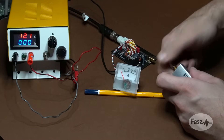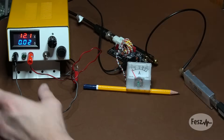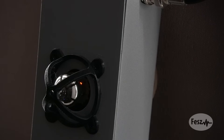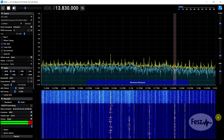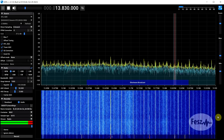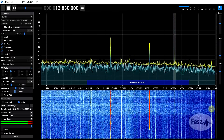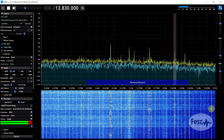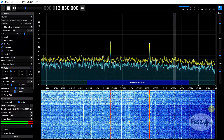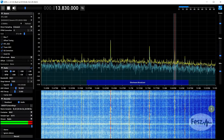To see if everything was in order, I connected this to the SDR and the loop antenna, turned everything on, and waited for the tube to heat up. And sure enough, the circuit does indeed seem to work — you can get quite a nice reception with it. However, this sort of test does not prove that the BIAS-T was built correctly, just that some amount of the signal is passing through it. So, to confirm the operation, we need to measure its various parameters.